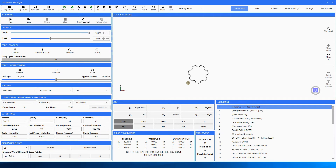What happened? This went from a quality setting — remember it was at 5, which was 60 thou, the factory settings — as soon as I change this to 150, it goes to custom. We could change other items: the voltage, the feed rate — let's raise it to 200, which is not a practical feed rate, but I just want you to see the numbers change. Once we have this dialed in, we need to save it. What a job does is save the program and your settings into a single file. It does not alter or change your original program, it doesn't change any factory settings.